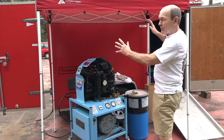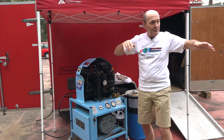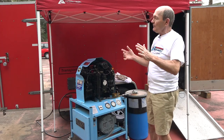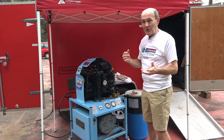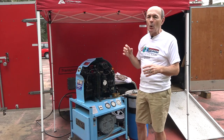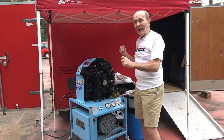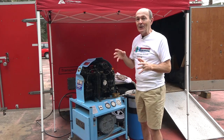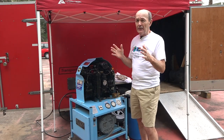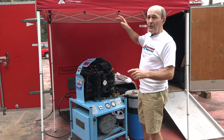You want the intake hose away from the heat, oil, and exhaust of the compressor — get it up as high as you can to avoid pollution from cars and trucks. You want the best air possible going in. Good clean intake air makes the filters last longer and the air safer. However, don't use a hose that's too long — say a 25-foot hose an inch and a half in diameter — because the compressor has to suck air through that hose and there's friction. There's actually a formula for calculating the correct hose diameter and maximum length. An eight-to-ten-foot hose is pretty common and usually enough.